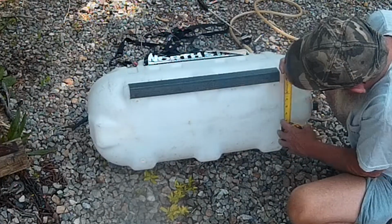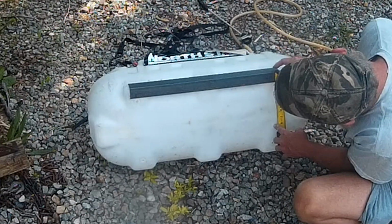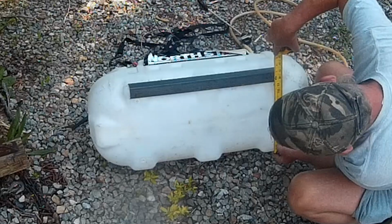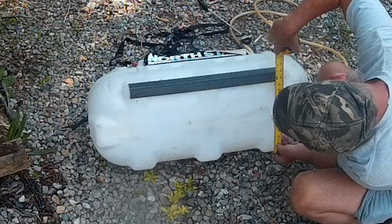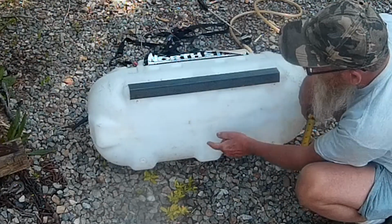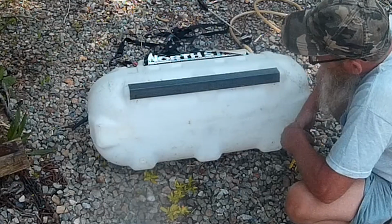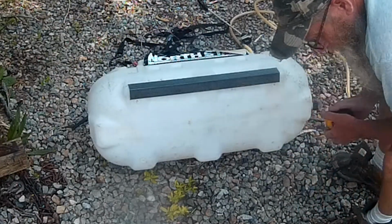So let's see, that goes like 2 inch from the center of this bolt hole to the other side of there. So 2 inch from there. Yeah, 2 and 11. So 13-inch long piece, 13 inches from here to here. I go cut 2 of those, and we'll lay it up here and see how it looks. 13 inches. Let me go cut 2 13 inches.